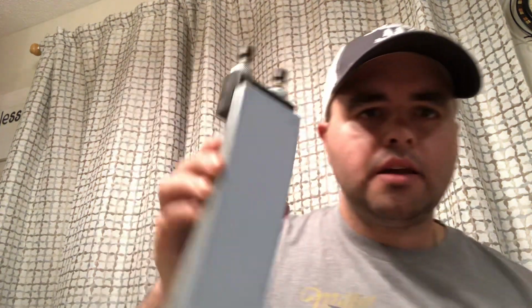I'm going to be using a Naniwa 1K, 5K, and an 8K. And I may, depending on how the bevel is, because this thing probably hasn't been honed in somewhere around 100 years, who knows, I may use my Atoma 400 to refresh my bevel setter here, my 1K. And then once I'm done with that, I should be transferring over and I will finish the razor on a JNat slurry.